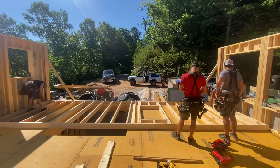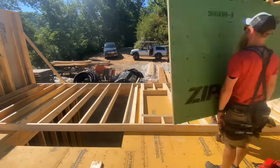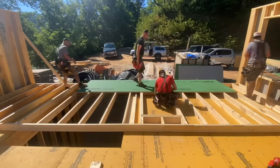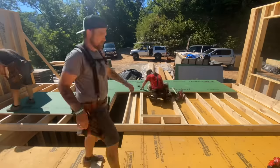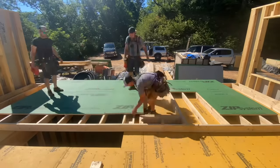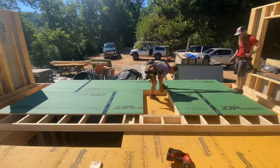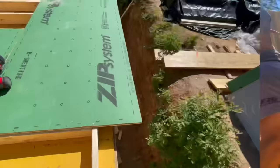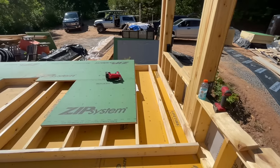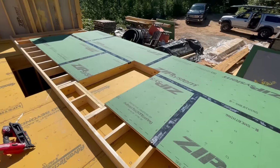The way we're going to do the sheathing on this wall is different yet again. We're going to let the sheathing hang down about 13 inches across the whole floor system and across the whole wall, and that will make the sheathing come up short of the top plate, which is usually not desirable. But in this case, this wall will continue up across another floor system and then on up the gable end to a peak. If we do it this way, we can actually lap the next row of sheathing across the top of this wall, across the next floor system, and onto the studs of the next wall, which will make it really strong. We are also leaving 32 inches of the sheathing off of this wall until we stand it, and then we'll apply those pieces, lapping them over the two walls that are already stood up.